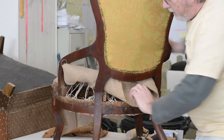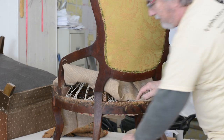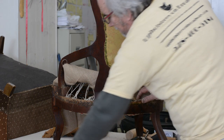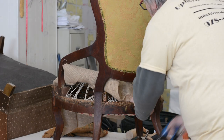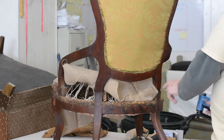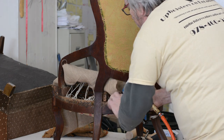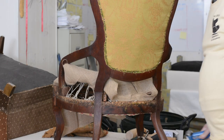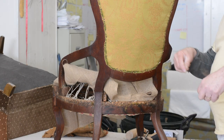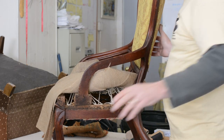I'm going to fold this and start at the back rail — we always start the back rail first in most cases. I'm going to fold this over and staple it. Stay about two or three inches from the post because you have to do some cutting there. For beginners, burlap is a great way to practice your cuts. If you make a mistake on burlap, no big deal. If you make a mistake on fine French silk, that's a big deal.